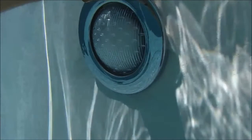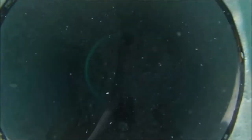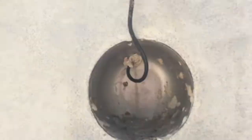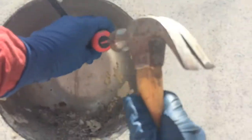There's a screw you unscrew while you're underwater — just jump in, take off that screw, and the whole light assembly will come out. Just pull it out; it has a long cord that's definitely long enough to bring above water level and work on it. In my case I drained my pool, which I had repainted — there's a video on that.